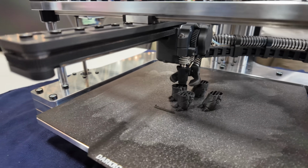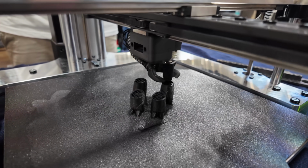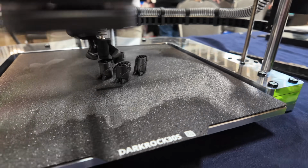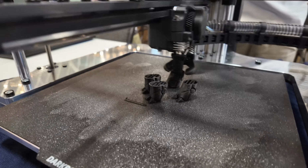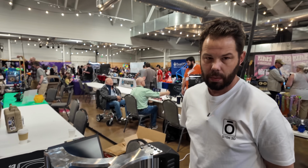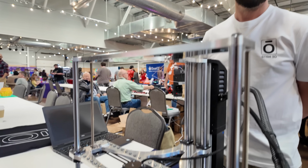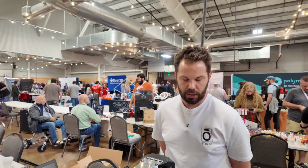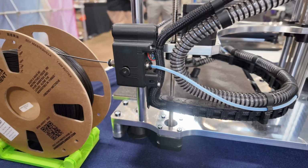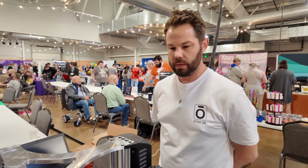And what kind of hot end are you running on this machine? It's Micro Swiss, all made in USA: nozzle, heat break, and heater. It is their newest generation. It's not released yet. High temperature, high precision. And for part cooling here, we got a tube going to it, so CPAP? CPAP 7040 in a rubber isolated box. Okay, because for a CPAP machine, this is actually very quiet. Thank you. We have this on the show floor, so there's a lot of ambient noise, but it's running pretty quiet. This is running at normal speeds. Yeah, not so loud.